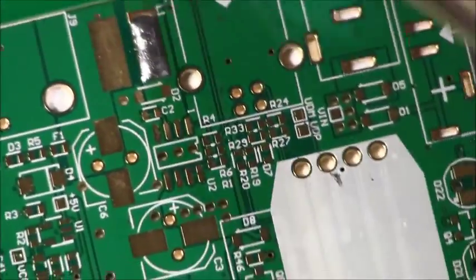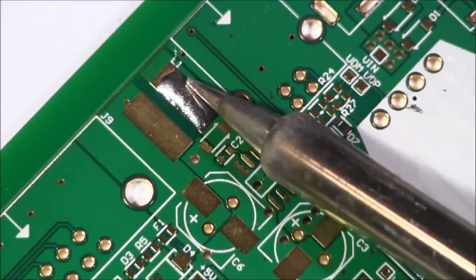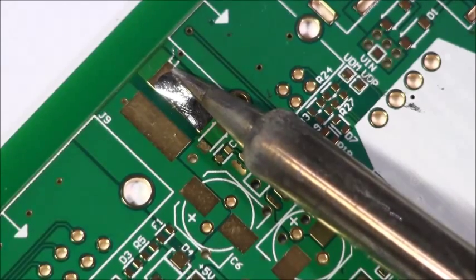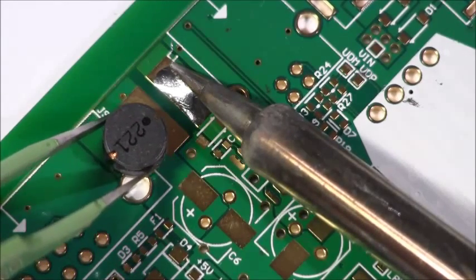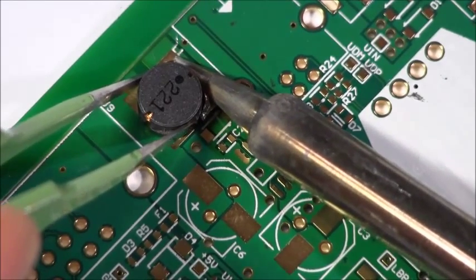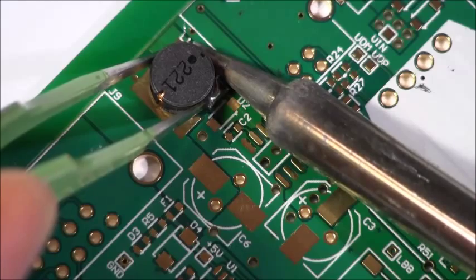Now that I've got my blob, I'm going to angle this so I can keep a broad part of my soldering iron on the pad, and get the part heating up even while I'm setting up. Make sure the part is correctly oriented — I'm using a slightly wider tweezer here as well. You drop it on the board, get a good hold of it, and start sliding it in. You have to kind of wiggle it a bit because it's going to start taking that solder and sucking that heat away, and slowly we're going to jiggle it to get it centered on the pads.